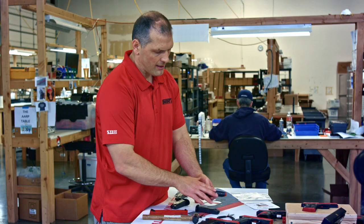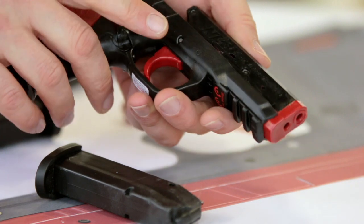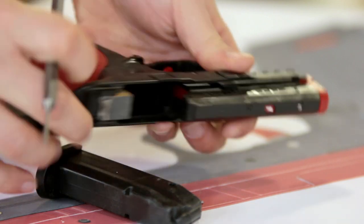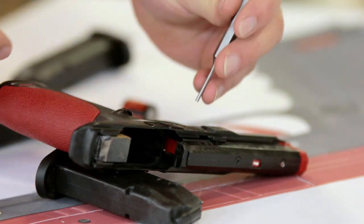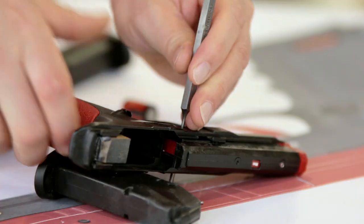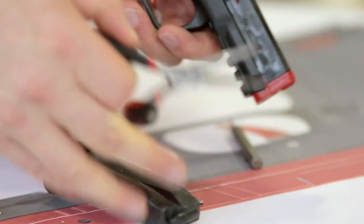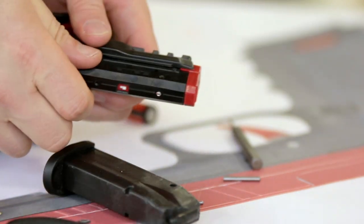All right, so it's one pin and this guy slides forward, disengages, and comes off. Now you have access to this internal trigger module. To get that out, we just take this pin right around the trigger and punch that out. They're different sizes so you won't get them mixed up, since the diameter is fairly significantly different between the two. I'll take a little needle-nose pliers to get it out.